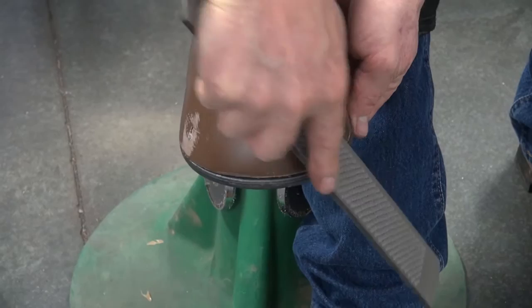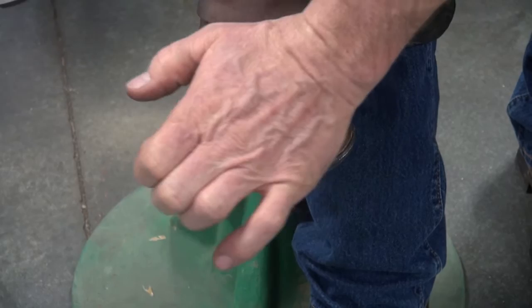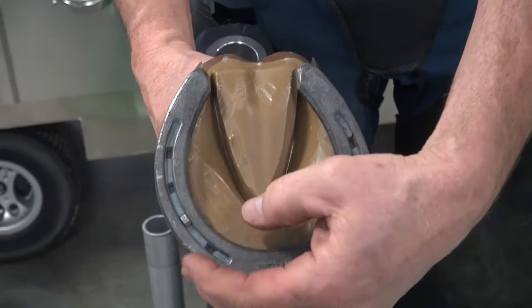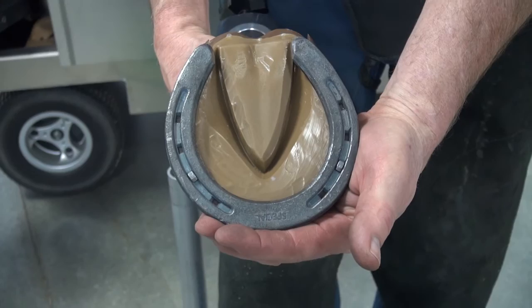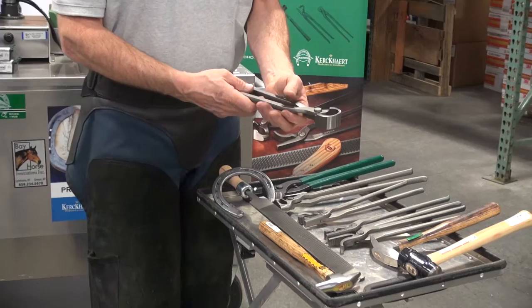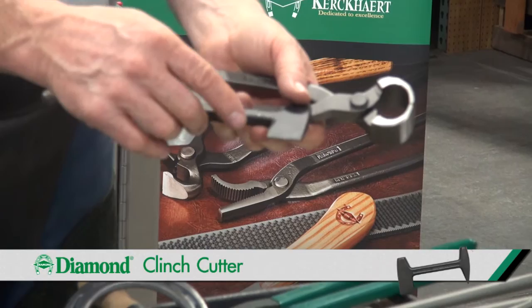This process is for the safety of the horse. Now we have a nail that's clenched, bent over to hold that shoe on. A shoe design has eight nail holes punched in it. You're going to use those nail holes which you feel are safe — just because a manufactured shoe has eight nail holes doesn't mean you have to use all of them. We may just use the first three. When removing the horse's shoe, we'll need pull-offs. First we would cut the clinch. That's the last step in the process of shoeing a horse.